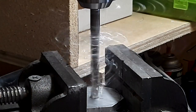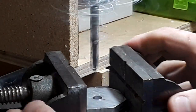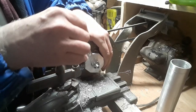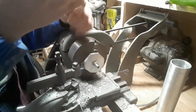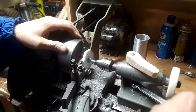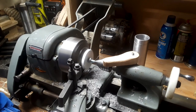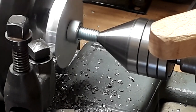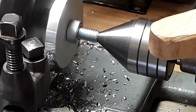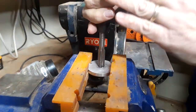After sawing off a piece of quarter inch aluminum plate I drilled a 3/8 inch hole in the middle to accept the 3/8 inch nut and bolt. This lets me hold it in the three jaw chuck on the lathe. The end of the bolt has been center drilled to accept the live center and to help keep it all stable and aligned. If you were to just turn the shank of the bolt and put it into the chuck, once you started the lathe up the nut would unscrew. I'm making two of these discs right now — one will go inside the pipe and the other large one on top of the pipe.